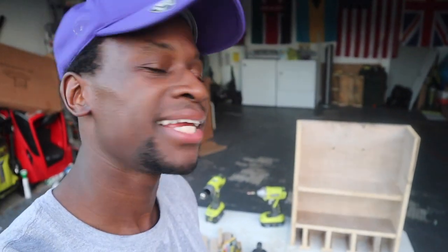The toughest part of this build that I like to share is that my table saw situation is not the straightest — there's a little slant in it and it messed up all my cuts. I realized I didn't have it leveled. So make sure when you're cutting with your table saw or any saw that it's leveled, because if not you'll have a little slant. My pieces have a little slant, however it is functional and it is mine. It was a pretty easy build overall — I was able to do it in about an hour and a half in real time. If you're better than me, you could probably do it in 45 minutes.